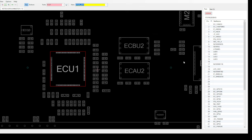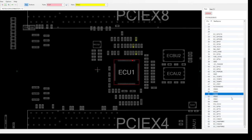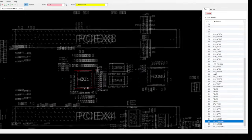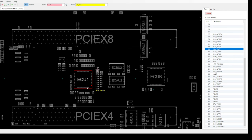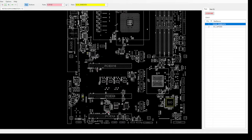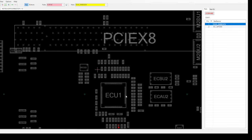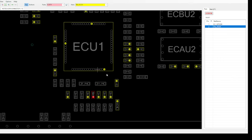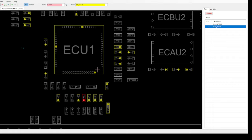I don't know how mandatory this chip is. There are two different EEPROMs next to it that are both programmed. Looking at the board view, this is marked ECU and we have VCCH here. This seems to be for monitoring power coming in, and this thing seems to be shorted. I can't really tell exactly what it's for - there's fan PWM, some fan stuff, VBAT, EC GPIO - not totally sure what this chip is responsible for.